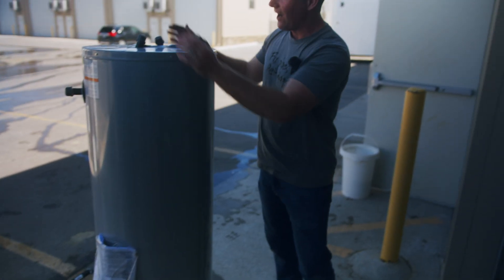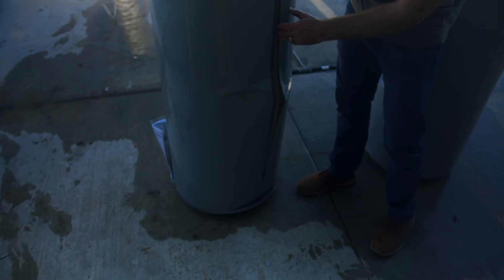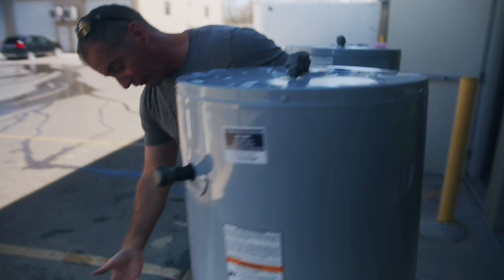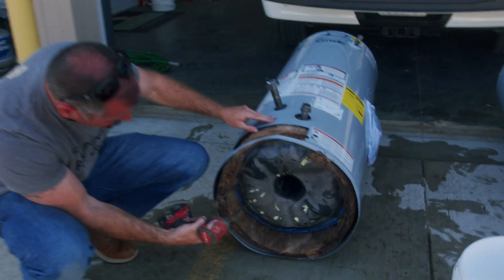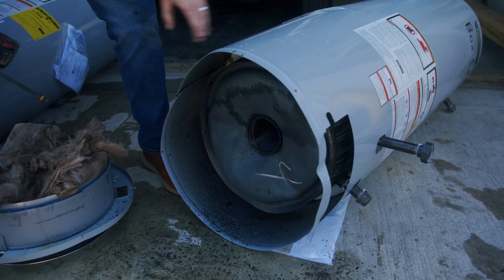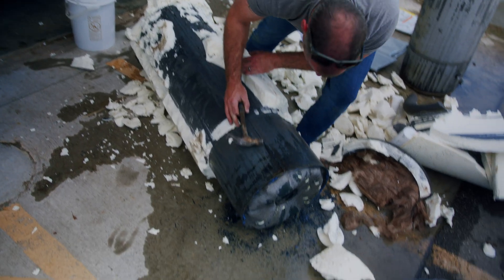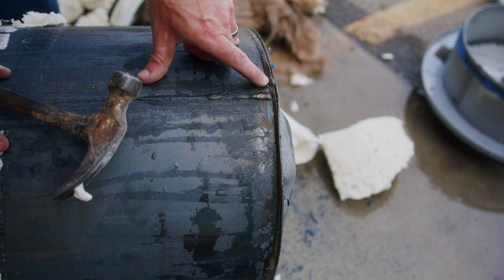The jacket and everything is fine — it just folded everything in on the top. Now over to the box store heater: it ripped the jacket open, moved everything around up top, and sunk these down in. The fronts of the heater look to be okay. You get a really good view into the bottom of the tank and see how flipped over that is — some really distorted metal underneath there. That is crazy. You can see down at the bottom how much the metal swelled. It only failed right here — that crack is where it finally popped and let go.